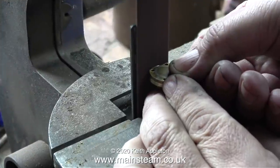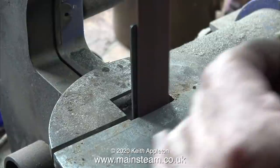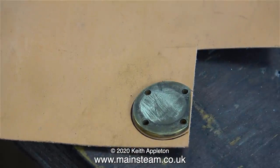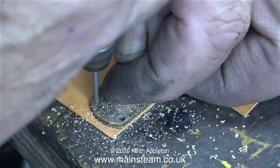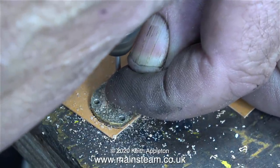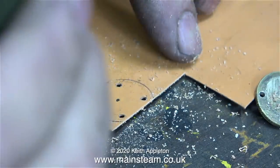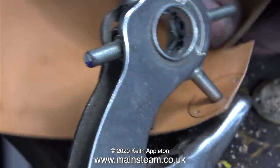Then it was into the outer part of the workshop and onto the one inch belt sander to square off the part. After doing this I applied a bit of heat to the assembly and the Loctite gave way. Here's the original part being used as a template to make a gasket — I put the twist drill I used into my Proxxon motor tool, drilled the four holes for the bolts, and used a hole punch to cut a hole in the centre.